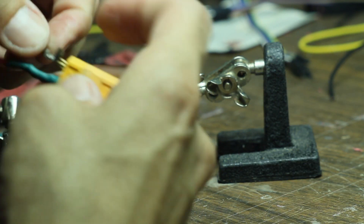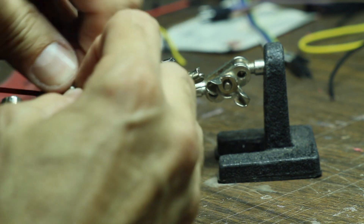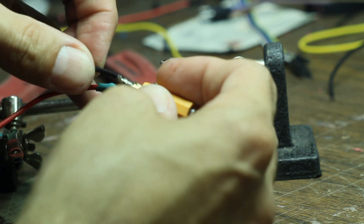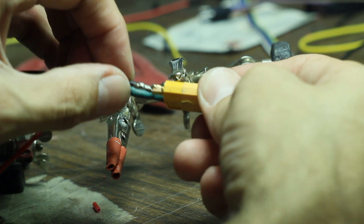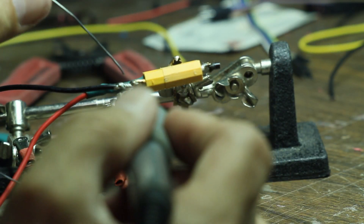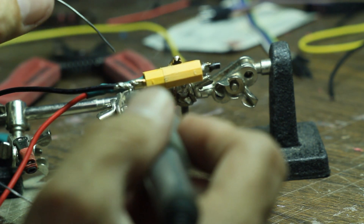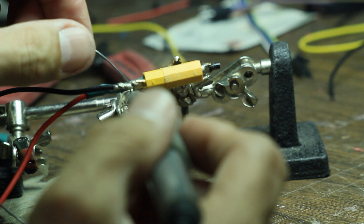I end up taking apart other connectors and stealing the wires. There are all different ways to connect wires and solder them together. My personal opinion is that it needs to be a tight connection. There's a little bit of wobble, but that's from the negative connector being bad anyway — the wires are connected well and twisted together. I'll apply some flux. I love this stuff — I didn't solder well before flux. Transfer some heat by putting it directly on the end. The rosin is pulling and sucking the solder in.